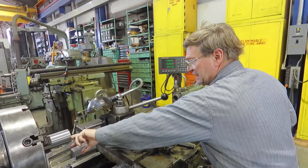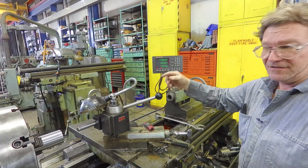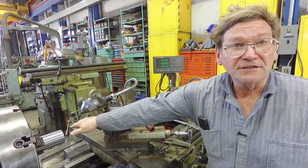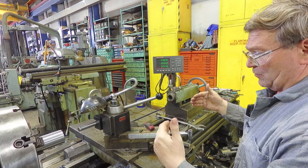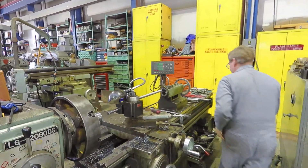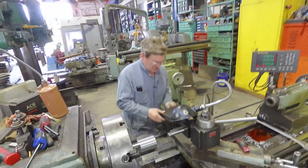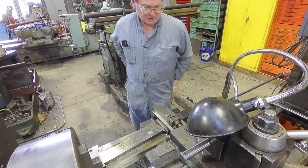I just got through cutting this inside. I'm cutting it on the backside — I'm turning the machine backwards so it's rotating this way, and my cutting bit is over here. The reason for that is when you're using your taper attachment in the back of your lathe. Some of you will have them, some of you won't. It's a taper attachment, and on this machine we don't do tapers here all that much — I used to do a lot, and it just goes in cycles.